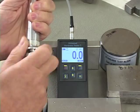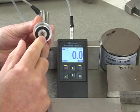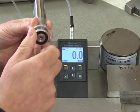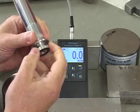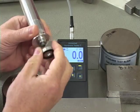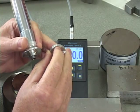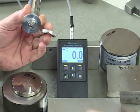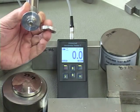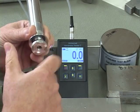Another feature of the puck is we can screw off the side which is for flat surfaces — it has a rigid rubber base to make nice contact. We can also reverse this end, which has two V-grooves cut into it: a larger V-groove for a larger diameter part so it sits nice and perpendicular, and a smaller V-groove for smaller diameters. This end can be reversed and screwed back on.